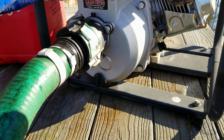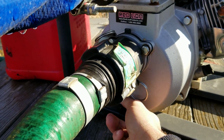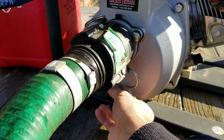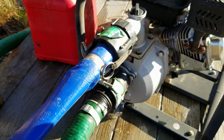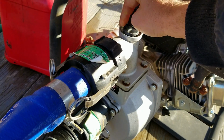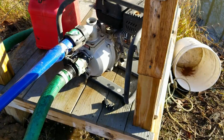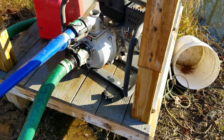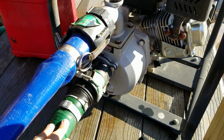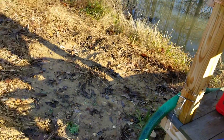Okay, so here we are at our pump. We're gonna drain some water out of it. There's that. Pull this top one off here. All right. The drainer's loose there. So now all I'll do is I'll take these two pipes off here, the suction and discharge, pull those off, pull the pump out, get that taken care of.